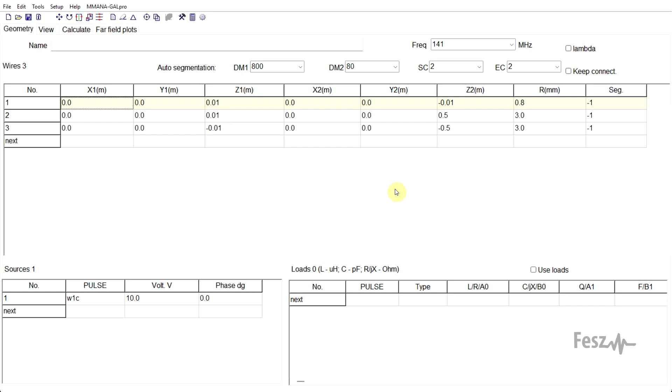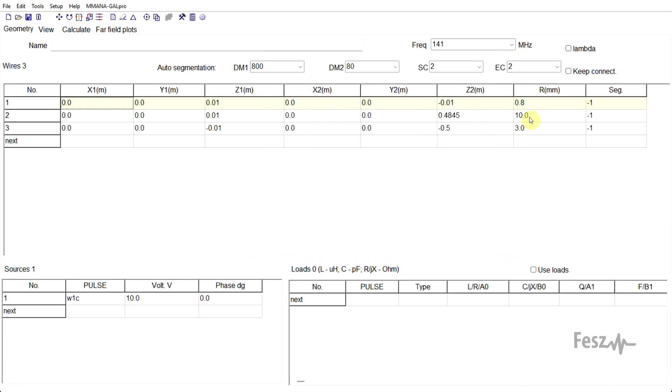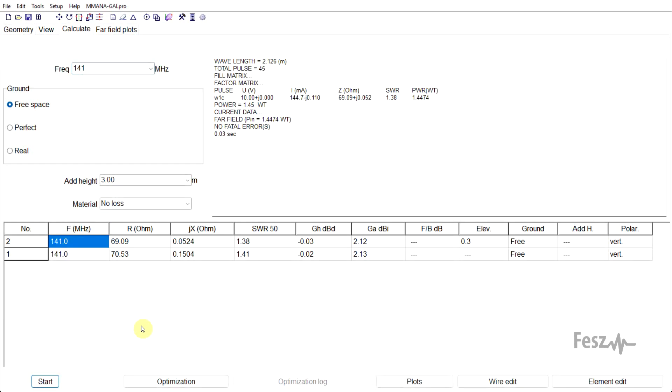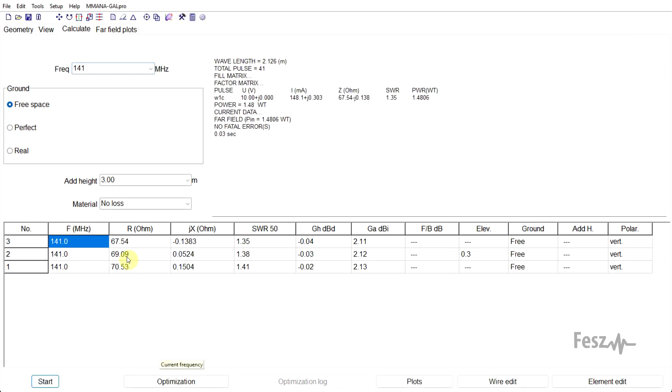It's worth noting that this small detail also changes the feed impedance. While a dipole built from equal diameter rods — 6mm in this case — has a resonant impedance of around 70.5 ohms, once we change the diameter and make one rod much thicker at 20mm and compensate for the length, we can see that the resonant impedance drops to around 69 ohms, about 1.5 ohms smaller. If we make both arms the same 20mm diameter, the impedance drops even more. By leveraging this property and making the arms of larger diameter, we can push the impedance down to potentially 50 ohms.